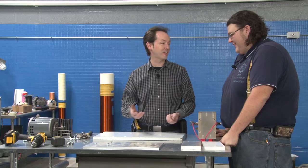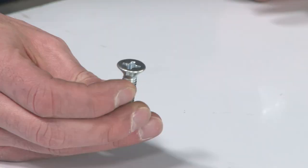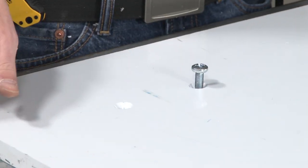It's all right, we didn't have to countersink in any way, I just wanted to teach people how to countersink. So if you use a proper bolt with a countersunk head, as opposed to one of these button head, these actually drop right in the hole and look great, look beautiful.